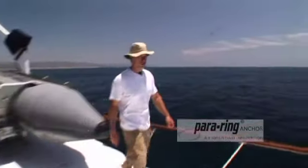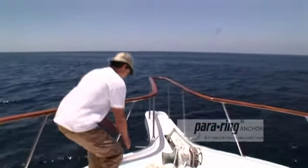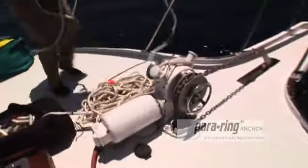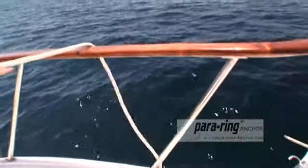Let's head up to the front of the boat so I can show you how this equipment is set up. I set up my gear when I'm in harbor when the weather is a lot calmer before heading outside, because when it's bumpy out there it makes it more complicated to set up your gear. You want to make sure you run your anchor rope outside of any railing or safety lines if it's a sailboat.